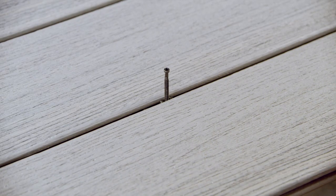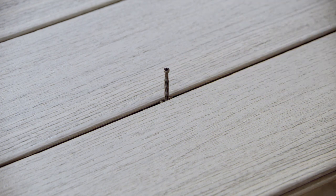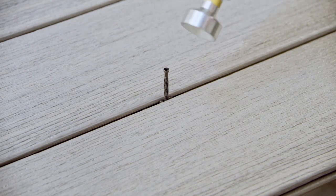Once you put your next board down, fasten the clips. The screw is intentionally a little longer than what you might normally see for a metal joist application, so you can easily and quickly fasten them down using the never-miss guide or standing up with the drive tool.